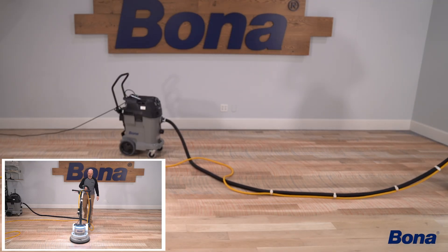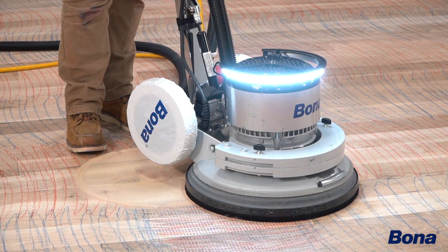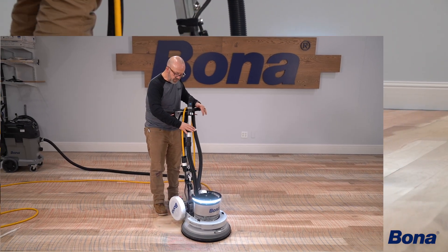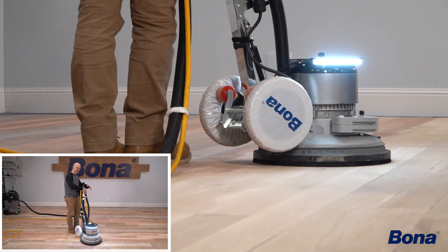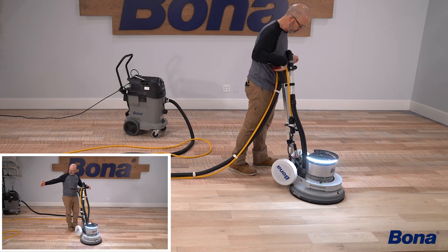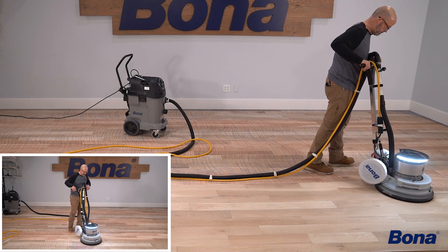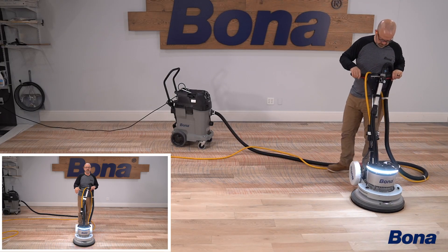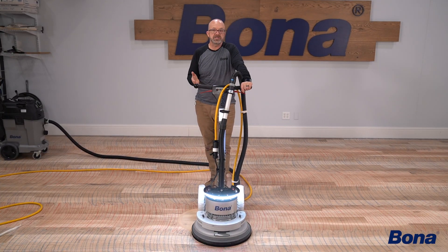So we're cutting in the back and feathering in the front as we move away from the wall — cutting and feathering, cutting and feathering. That's position one. Position two: if you need to be a little more aggressive, because we know we're cutting heavier between five and seven, I just move that cut point so it's moving more across the grain. In this instance, my path would start up at the wall and move down in this angled position.